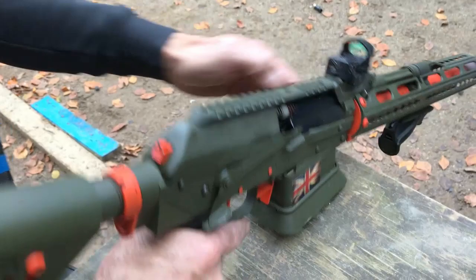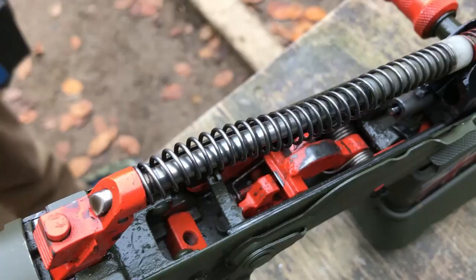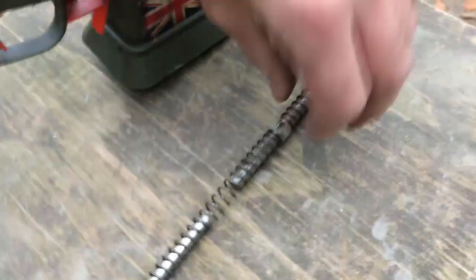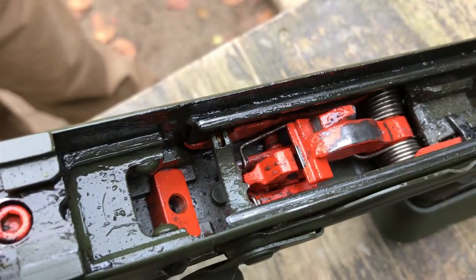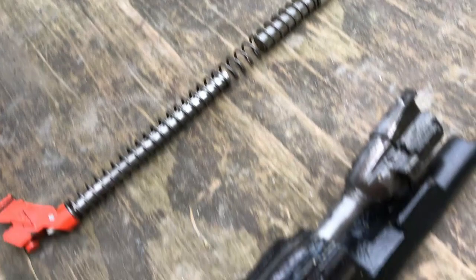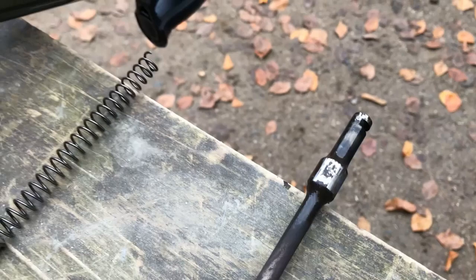Let's have a look at some of the internals. At its heart, this is a Molot Vepr, which is an AK-pattern firearm, so it strips down the same way — just check the chamber. As it is a Molot, the top cover remains attached; it doesn't come off like an AK you might be familiar with. The bolt comes out very easily. You'll note the colour-coded internals — you can see the trigger and also the custom buffer spring system. The gun is manufactured such that they've shaved the bottom of the bolt so that rounds can be loaded with a full magazine on an empty chamber and you can still rack the action. Many of these features can be done to your own equipment — you can send them your bolt carrier, for example, and they will fit the left-handed cocking and modify the bottom of your bolt. These are all services they offer as standard if you ask them.